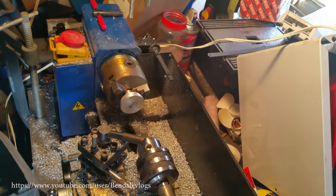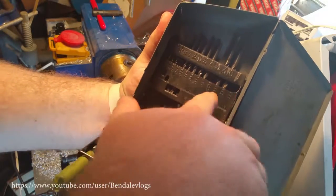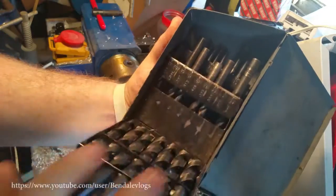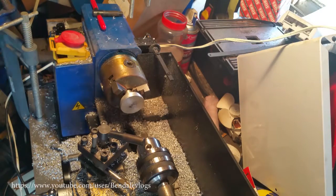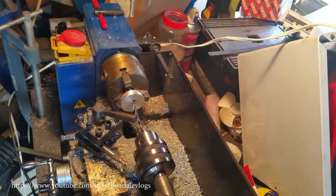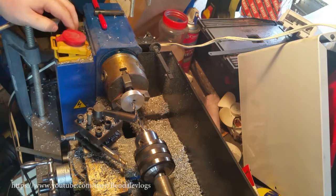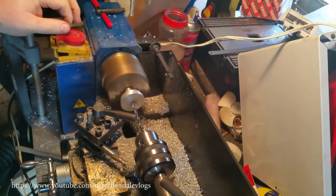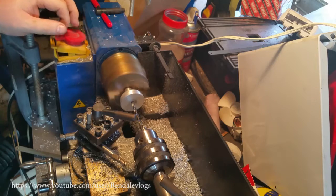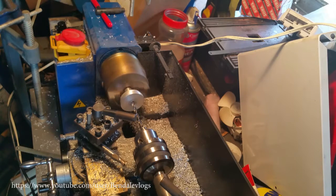So what I've done, I've gone into my drill index and I've pulled out my, what is that, 13/64, which says it's 0.203, 203 thou. The number 7, I believe, is 210. So I'm going to go in, well, let's say 3/4 inch. Bounced around a little bit just because that hole was a little weird shaped, but once it hits the center drill, it's fine now.